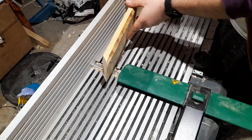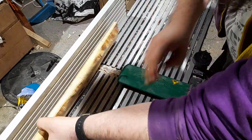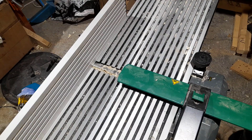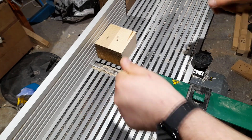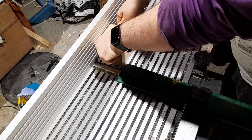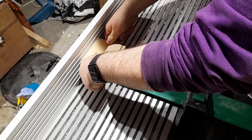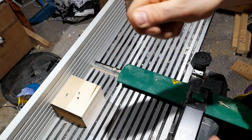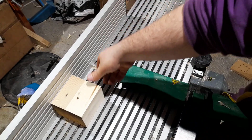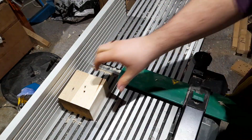The same applies when you're going through the top. Exact same thing: never have your hand over the blade. Now, because these are very short, I'm using a different variation of this, where I'm using my thumb and this knuckle. So I'm holding them up here and making sure to make fists with the rest of my hand. That means that although I have good contact and I can push it through well, this is all the amount sticking down the timber. As long as I keep that and I keep my hand well balled up, there's no risk of me hitting my fingers. If you were pushing like this from behind with your fingers down, you could very easily clip the top of the blade. Safety first.